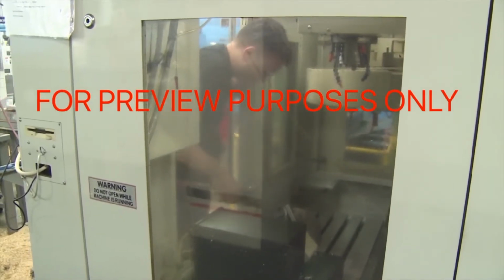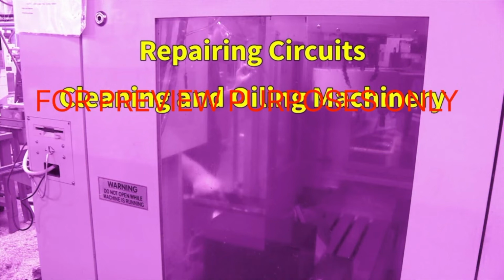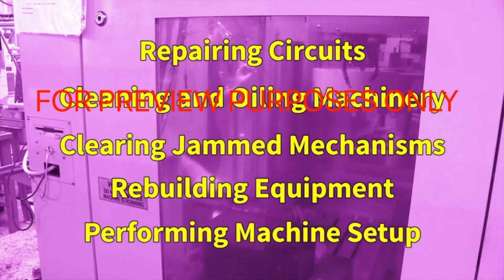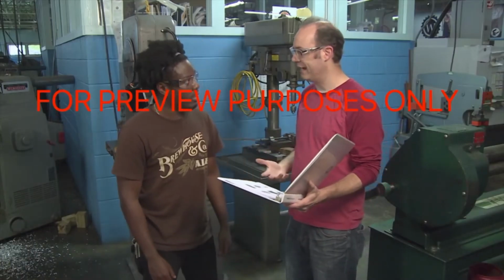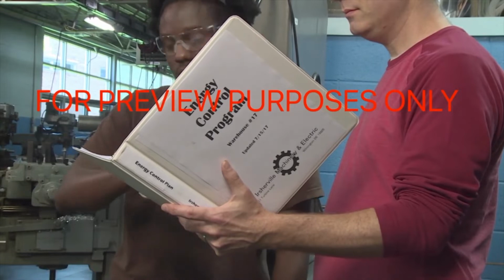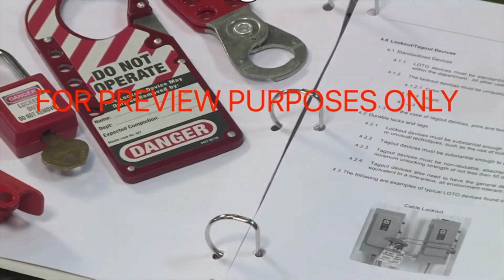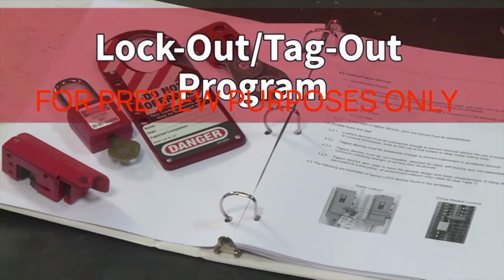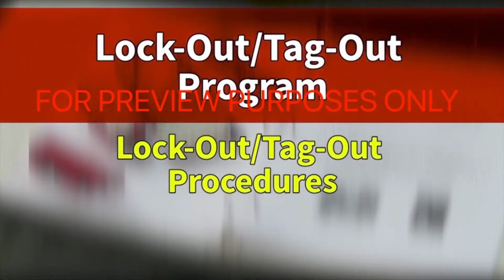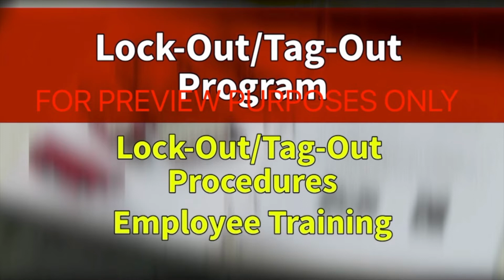Situations where lockout-tagout procedures should be used include repairing circuits, cleaning and lubricating parts, clearing jammed mechanisms, rebuilding equipment, and performing machine setup. So that employees will know how to deal with these situations safely, the OSHA lockout-tagout regulations call for all facilities to implement an energy control program. This must include a written lockout-tagout program consisting of two major components: lockout-tagout procedures for all of the powered equipment and machinery in the facility, and a plan for training employees on these procedures.